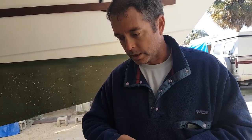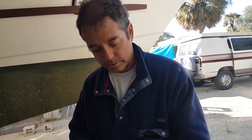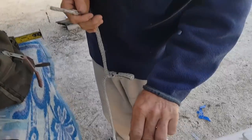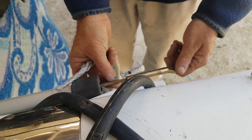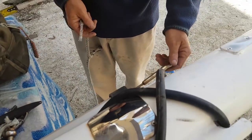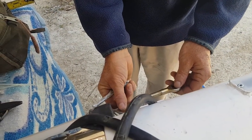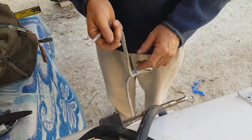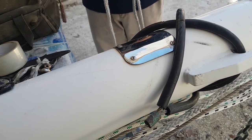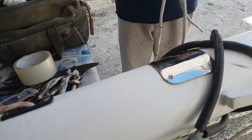And then for a furler, you still have to go with wire, but I would have used 1x19, not this 7x7 or 7x19 stuff that this is. Which actually works a bit better in the furler too, because the outside of it ends up being rounder, so it just runs a bit smoother. Anyone rigging a new one, it sounds like 9mm Dynex is the way to go. It's much easier on the hands as well.